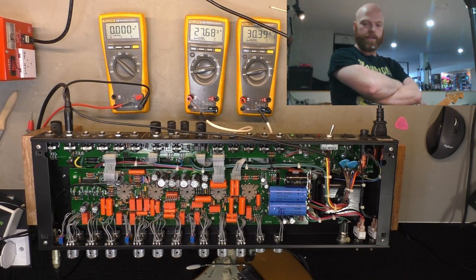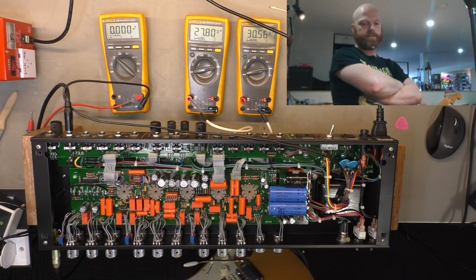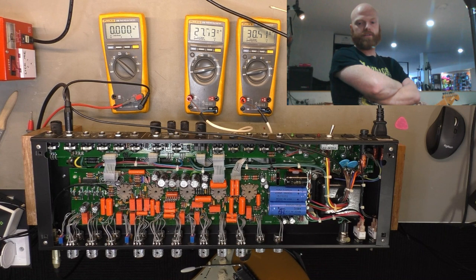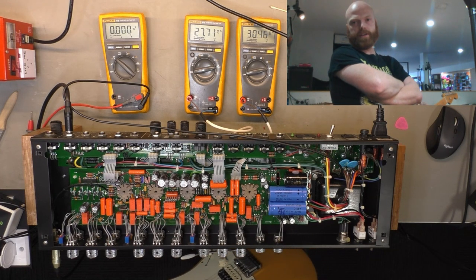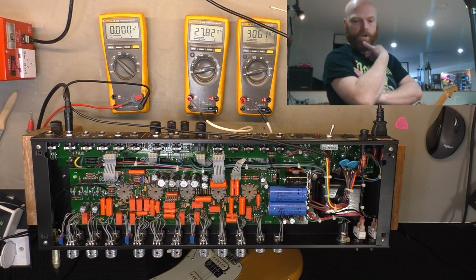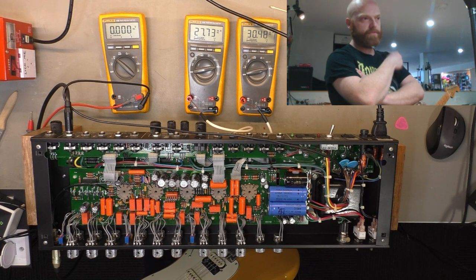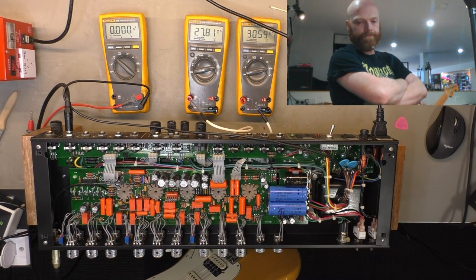So this came in solid state mode on the switch on the back. So I'm going to ask the customer if he wants to just leave them out, because you can do that. It generates less heat because those heaters are always on in the back. The voltages are within spec without them installed, so that's fine. And maybe just leave them out.